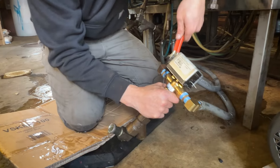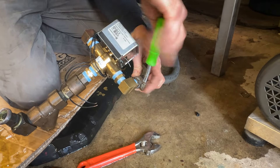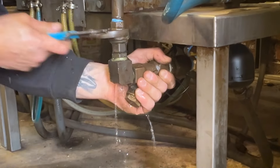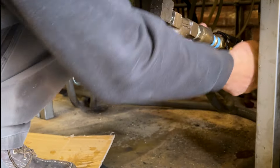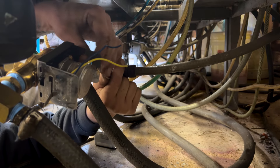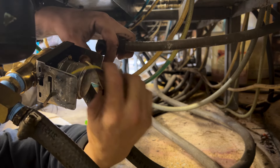In my CAT pump I was still getting that cavitation, and I definitely figured out that I'm losing some water flow to the pump suction. So getting everything back together, hose clamps back on — water supplied, seeing that coming through that valve as it is now. I'm just going to get the wiring back and get my seal tight back inside the valve.